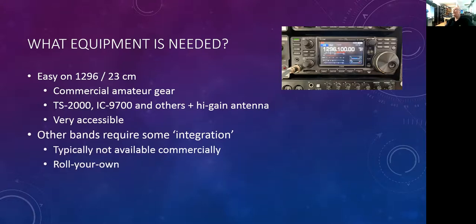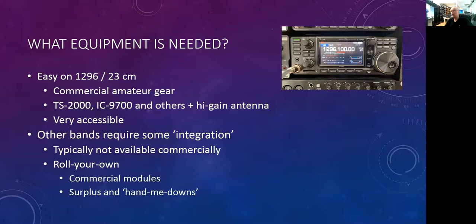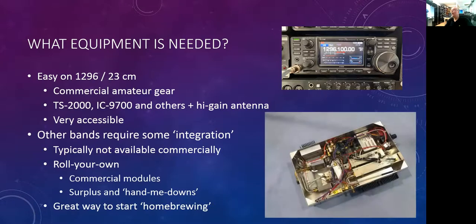The ARR TR-10GA and TR-24GA were FM radios — wideband FM — and we don't use wideband FM so much anymore, primarily single sideband and other weak signal modes. So these radios aren't available commercially and you have to build your own. The good news is that a lot of the components are available commercially, show up in surplus, and can be hand-me-downs found on eBay. This happens to be a photograph of my dual-band 10 and 24 gigahertz transverter — the heart of my microwave radio.